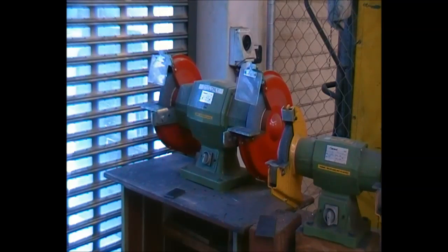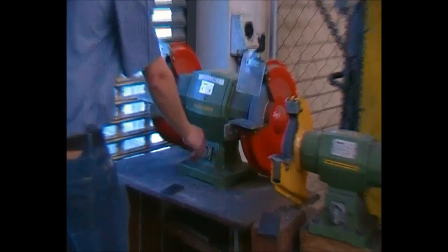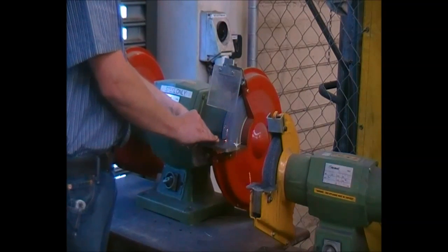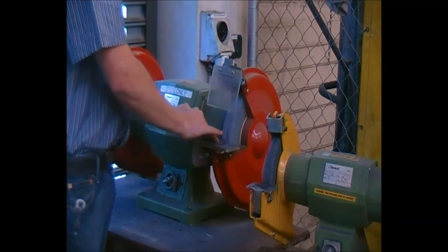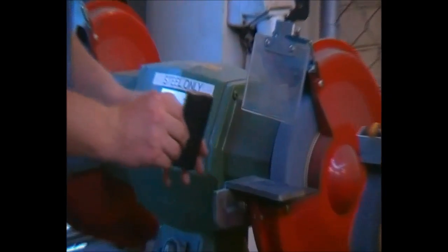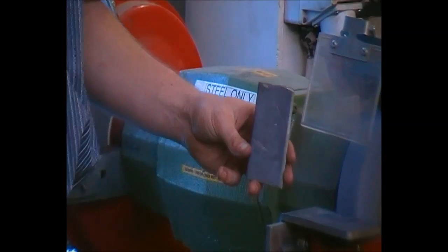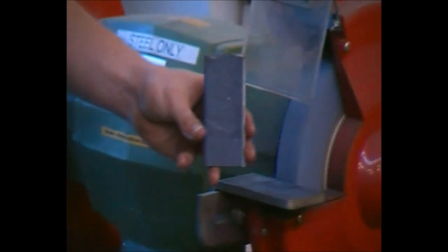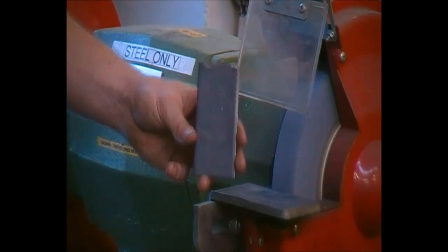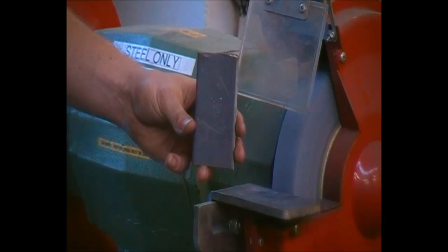Please beware of this. A short demonstration of how it is used is going to be shown now. Please wear the correct PPE such as safety glasses and closed shoes — nothing that can get caught onto the machine. Please adhere to all of these rules. Let the machine come to a complete halt before operating on it. Please note this is a lovely machine to take off burrs but is not a milling machine — please do not try and cut slots into complete parts. Rather deburr or make a part safe by taking off the sharp edges. Thank you for watching.